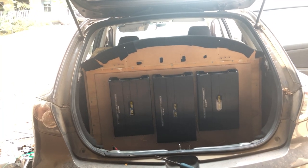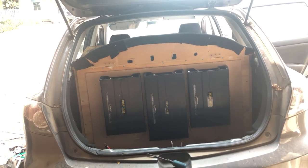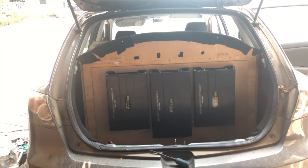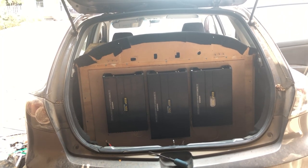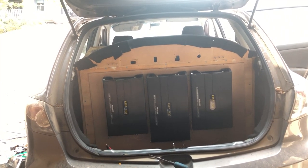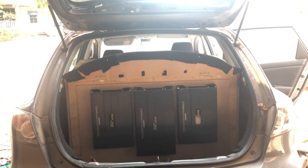I'm pretty sure they will because that middle amp, I shorted out the output of it once and the thing just decided, oh, am I a welder, and put out so much current it's ridiculous. But it did it, so I'm pretty impressed. So these amps seem pretty robust. I know they like to get hot already, so that's a bit of a worry. Already heavily biased, which I think is why they sound so good. They also draw a ton of current at idle, but I love them. They sound so good.